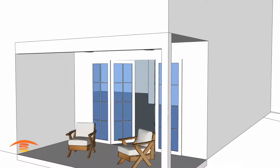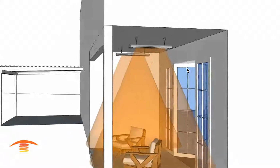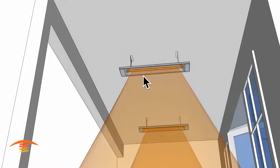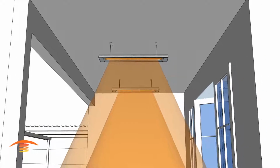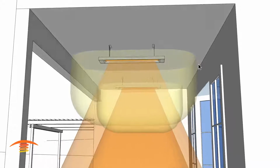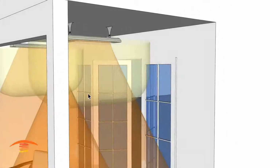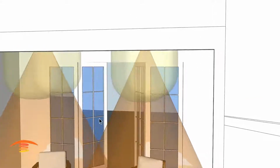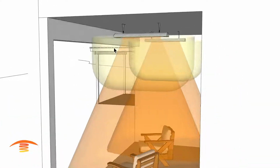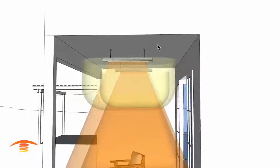So let's look at the second option. The second option would be two of the WD either 5024s or 4024s. They have two elements. They're shorter units, and they also have a clearance at the bottom. That clearance you can see is met. And of course the doorway here again has to be something that would be opening inwards and not outwards for this unit to be possible here. So that would be a second option.